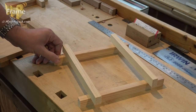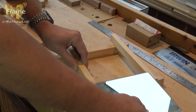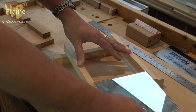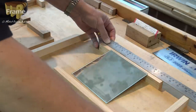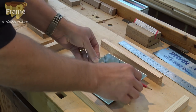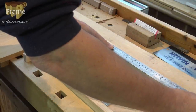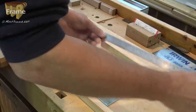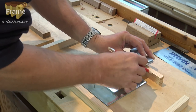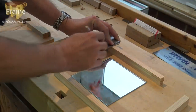That's roughly how we're going to lay them out. I want to have it capture the mirror in a very slight groove, so all the pieces want to be slightly less far apart than the mirror is wide, and it's a square tile so it's fairly easy to do. Now I want to centre my tile, so let's find the centre point here. Now if I sink my mirror in to each side by about a millimetre all the way round, that should be enough to hold it together. So let's just mark in from those edges one millimetre.